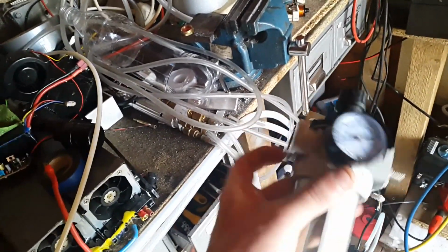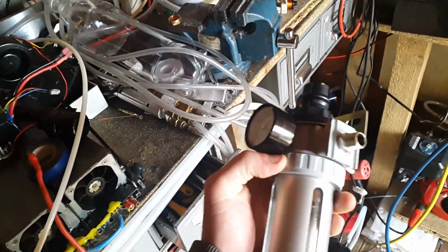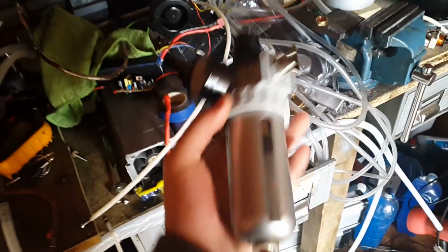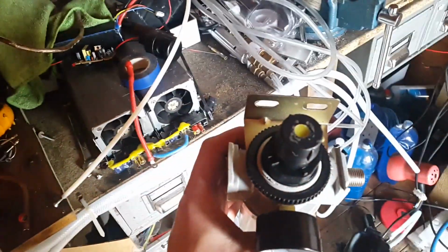But what's going to happen is just before this water trap there's going to be a coil of 8mm microbore in very cold water, so it'll be like a very large refrigerated air dryer, and with this water trap being larger it shouldn't be too much of a problem. Should be able to catch everything, and I don't think the compressor I'm going to get will spit oil.